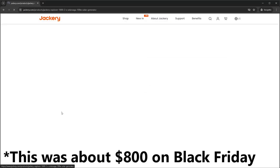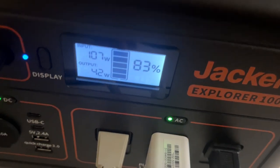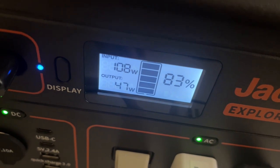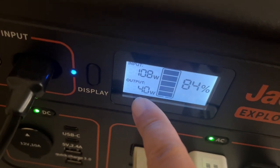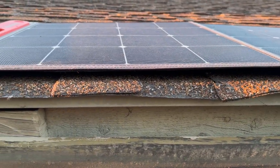Adding on these solar panels was pretty expensive though, with this Jackery battery being $400 and 200 watt panels being another $400 during the last sale. So given that it's generating about 1 kilowatt of power each day, it's going to take around 4 years of continuous use to make my money back on the solar panels.